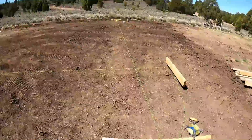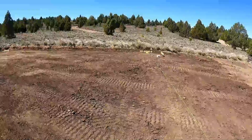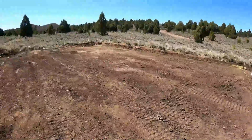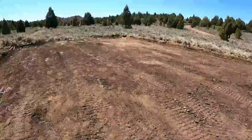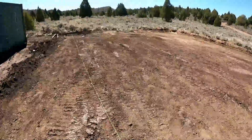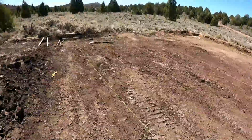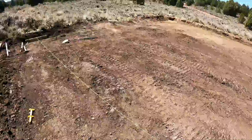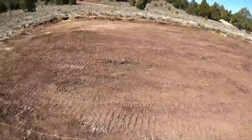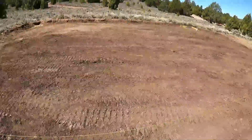We've got our batter boards all set up. This is a 35 by 50 slab. We're ready to start forming it up. Get the rebar tied in there. This is just for an RV, so we're not doing a footing under it. He didn't want to pay for a footing, but he's just going to park his RV on it.